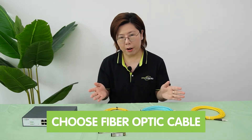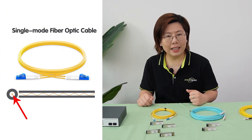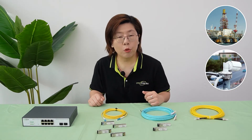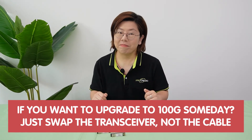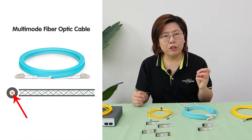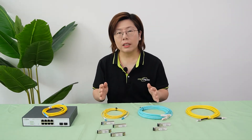Then you'll choose your fiber optic cable — single-mode or multimode — depending on how far your data is traveling. Single-mode, like OS1 or OS2, uses laser light. It has a thinner core and can go miles. If you have cameras on a remote oil rig or highway miles away, single-mode laughs at distance. Plus it's future-proof — if you want to upgrade to 100G someday, just swap the transceiver, not the cable. Then we have multimode fibers like OM3 or OM4. They have thicker cores and shorter runs, usually up to 550 meters — great for campuses, office buildings, or server rooms. Think of it as a sports car: fast but only on a short track.